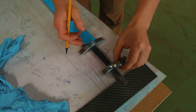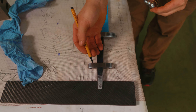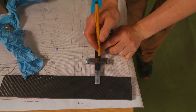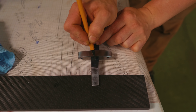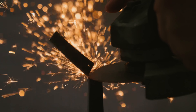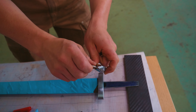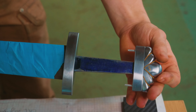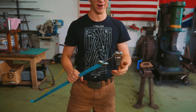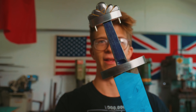First things first, so that we can make sure that our design works well, I want to be able to have the pommel on the upper guard while the upper guard is on the tang. We've got a little pencil line for where the top of the upper guard sits and we'll cut enough material to be able to peen the tang nicely — we'll do that with an angle grinder. On with the lower guard, I'll put the silver rivets in the pommel. Look at that — phenomenal.